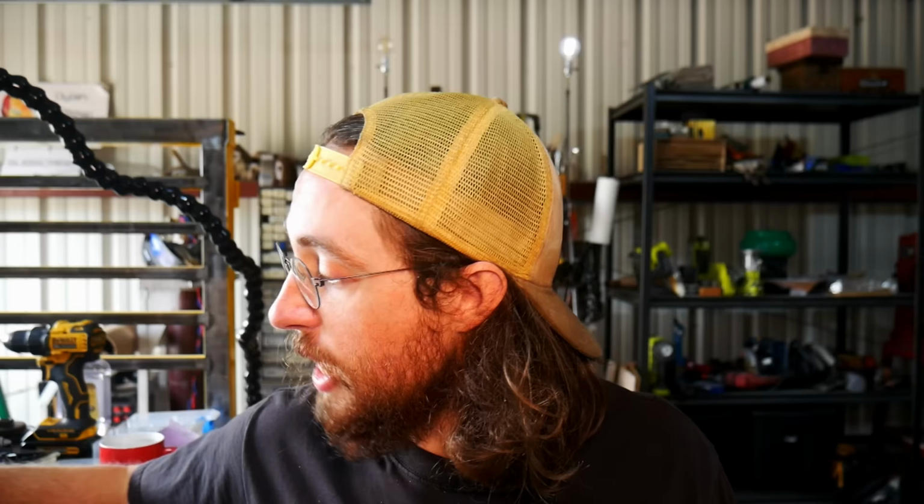It has a lower reduction because it has 3 points, and the reason I'm using 3 points is because it makes a perfect plane, so there's no weird flexing. There's nothing flexing. There's no compliant mechanism on this at all. So there's nothing that causes the fracture, because that causes work hardening or fatigue or whatever to set in on the material. So that's completely gone, and I'm able to use that to generate the output.